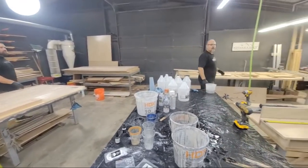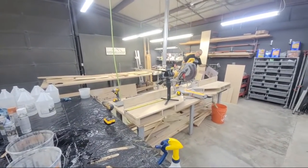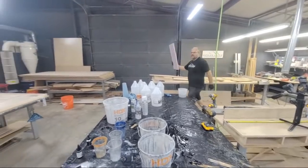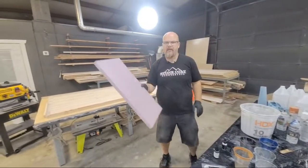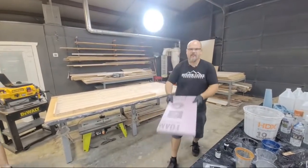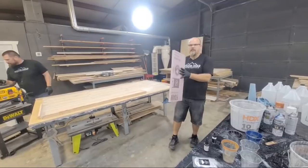What kind of foam are we using? Owens Corning pink insulation foam — that's what we're using to put in our shower walls. Why did I go with foam and not MDF like I've used in the past? MDF — I get a lot of comments saying your shower is going to get destroyed using MDF in a wet area. Not if you use a waterproof membrane and then encapsulate it — epoxy is about the most waterproof thing you could apply.